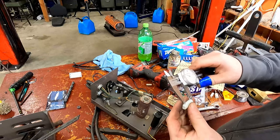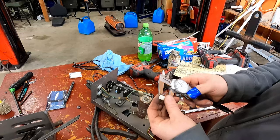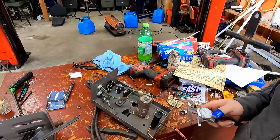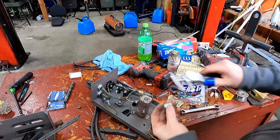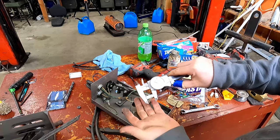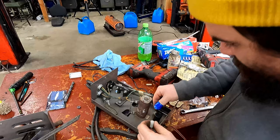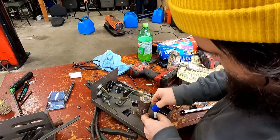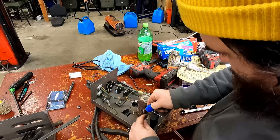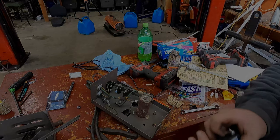All right, we're gonna do 0.780 because that looks pretty good to me. I'll be back in just a minute with this piece. All right, we're back, and we've got our spacer, which slipped in the chuck, which is what those marks are. 0.782, I mean, come on. For what I was using to make it, that's pretty darn good. The question is, yeah, that'll work actually.